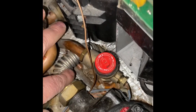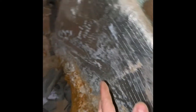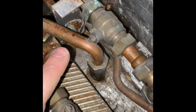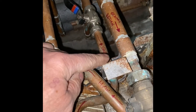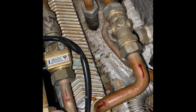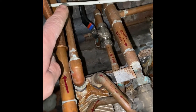In hot water mode, it still comes out of the primary heat exchanger and takes the same route through the pump, but here the diverter valve is in the hot water position and it goes down to the buffer tank, heating up the whole tank. It will then come back out of the buffer tank and run parallel with the cold mains in the plate-to-plate heat exchanger. The two waters there extract the temperature into the cold mains, and the return water goes back into the secondary heat exchanger, then returns to the primary heat exchanger. Your cold mains flow comes along here, triggers the flow switch, then goes along to extract the heat through the plate-to-plate heat exchanger and comes out the other side toasty hot.